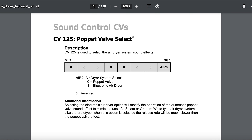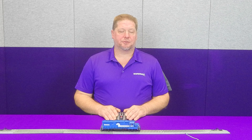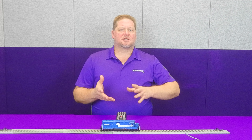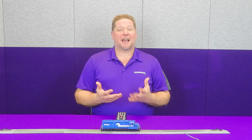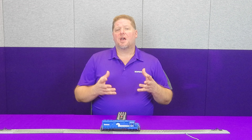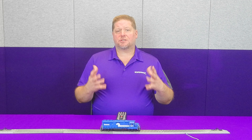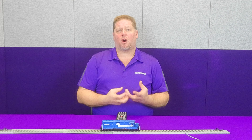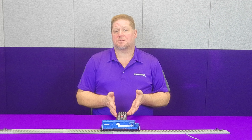The air dryer is a more modern appliance. It started around somewhere in the 90s, probably the 2000s, but it's just a different system to dry the air once it's compressed. When the moisture in the air is compressed along with the rest of the air, the water condensates and that water has to be expelled out of the system.